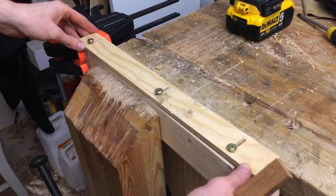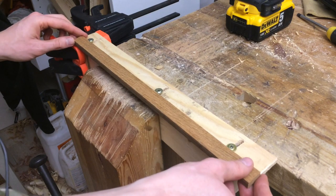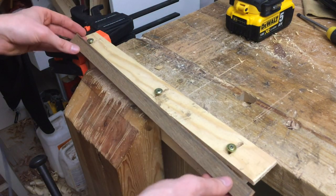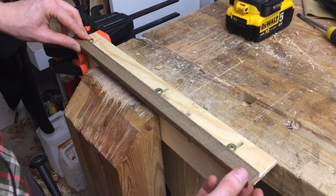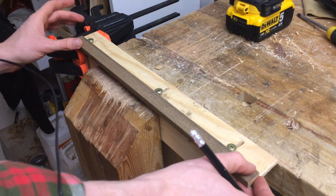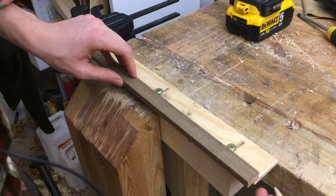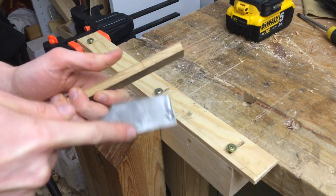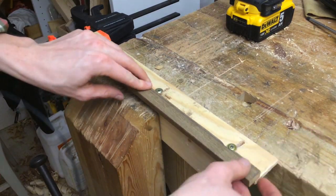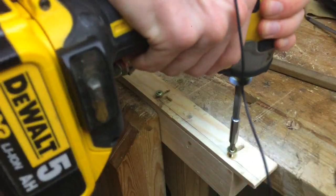This piece can now slide up and down, but I need something to constrain the plane sideways as well. So I have a thin piece of oak here that will be glued on to the side of the moving part so they move as one. It doesn't matter so much how high it is — it just needs to be high enough to trap the plane and keep it from moving off the jig. I will place the oak up against the screws and see if there is enough contact surface between the two to get a glue joint. On this end I need to bring it down a little bit further. I think that's going to be perfect. So now I just mark how far down the oak needs to go, and now I know where to apply glue.